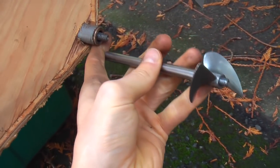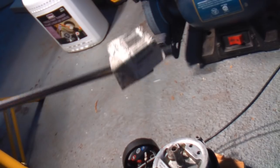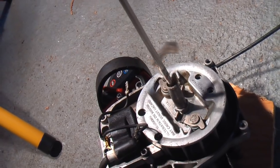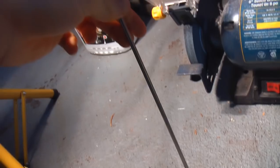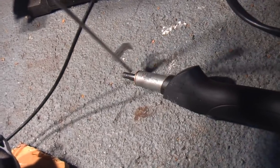I finally made it down to my hardware store and picked up this 3/16 inch steel rod, or approximately five millimeters. As it is, it doesn't fit into the flywheel hole, but with a bit of grinding I should be able to grind the end square so it'll fit in and secure itself nicely. Then I'll use a hacksaw to chop it down and grind the other end square so it'll successfully take the power from the flywheel all the way down to the threaded rod at the end.